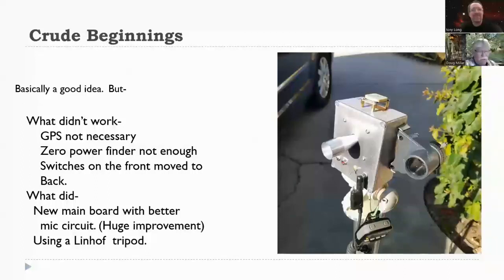But what I did keep was that there was a second version of the board which came out. The problem was it's an FM circuit, so without a limiter on the microphone circuit, the louder you talked, the weaker your signal got. So when you're getting really excited, the signal disappears. You can't aim it or anything. So the limiter was a much more tame radio and worked much better. Still, with a horn, it was 3 miles or 4 miles on an average day. Lots of fun. And Tony and I have worked each other several times.